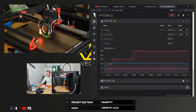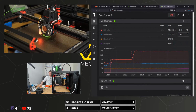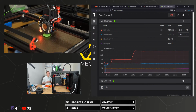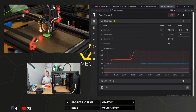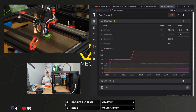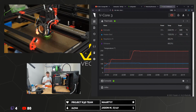Yeah, it is expensive stuff. The thing about carbon fiber is it does actually generally make more warpy prints or more warpy filaments easier to print. It makes them more dimensionally stable. So when you are printing things like nylon and PEEK and stuff, having carbon fiber does actually help the printability. Supposing, of course, you've got appropriate nozzles for the wear resistance.